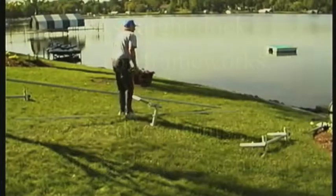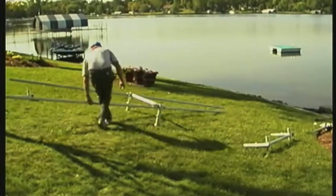As you slide the 16-foot pipes through the continuous bracket, take notice of the 16-inch sleeve for the vertical pipe, and make sure that the set screws on the vertical sleeves are all facing back toward the open end of the frame. Then, as you are installing the dock, the set screws will be on the same side towards shore or the main walkway.